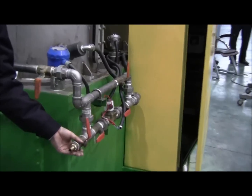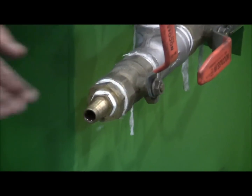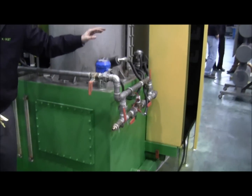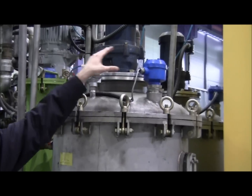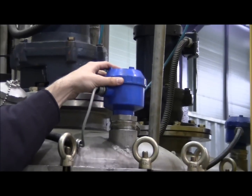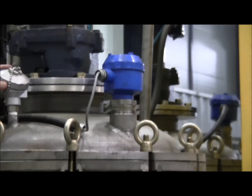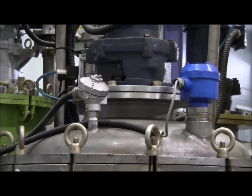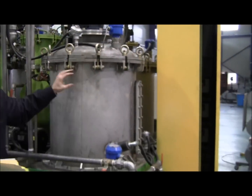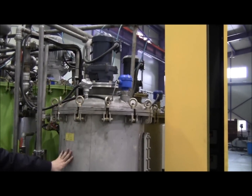This right here — you hook a hose up to it — is where fresh water comes in. On the machine you'll see blue and silver indicators. Blue indicates the level — it's a sensor. Silver is the temperature gauge, automatic turn on and off. Each of the tanks has its own specific temperature to be set at, and these are the sensors that identify it.